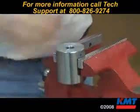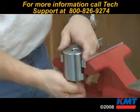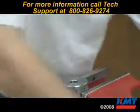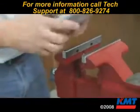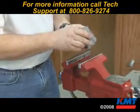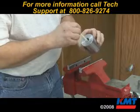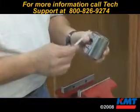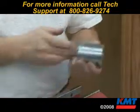To remove the seal, use your push tool from the bottom, push it out and remove it. Inspect your body pretty good and clean it out, blow it out with air. We do not want any scratches inside the bore area where the seal sets. If you have any scratches in there, chances are your seals are going to leak. So we want to clean it out real good and inspect it.